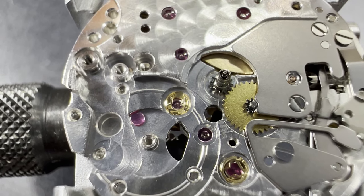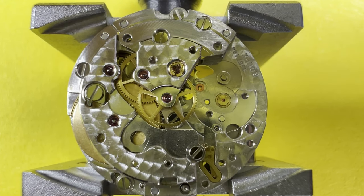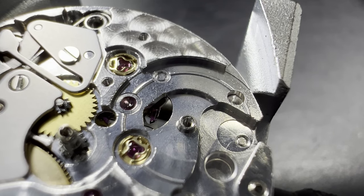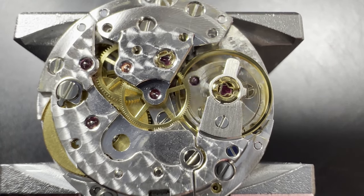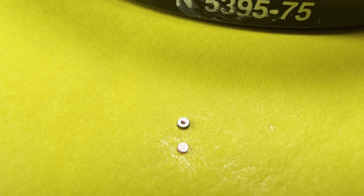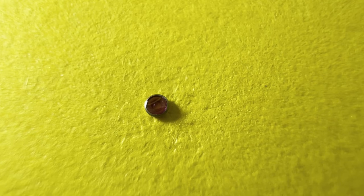As we're on the dial side now, we're going to clean and oil the end stone of the escape wheel, as well as oil the other pivot holes. The movement is then turned back over, and the pivot holes are oiled on this side, then the pallet forks are reinstalled. The movement is turned over once again to the dial side to oil the impulse face of the pallet forks through the rather handy holes. The movement is turned back over again, and the balance wheel is installed. Now the capsules can be removed, cleaned, and oiled — you can see the small drop of oil — and then reinstalled. The same process is done for the capsule on the other side.